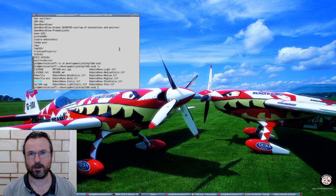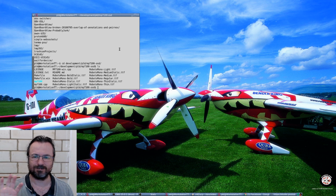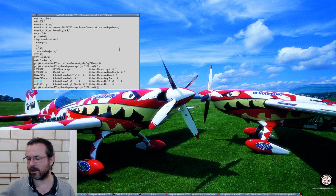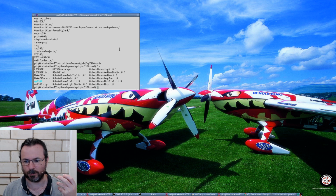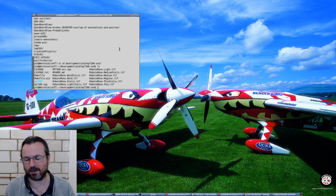Okay, so we'll get into it. The other night you saw we got the power supply up and running with the software. When I went to see if I could move it over to Windows, there was a bit of a drama with the driver situation, the USB driver for the USB TMC. It was more difficult than my alternative, which is that these power supply units also have a serial port. I didn't bother with the serial port the other night because I thought I'd try the USB, and Linux had direct communication with the USB driver, like you could just echo to the port and then read back. It was dead easy. But we're going to do the serial version tonight, which means I'm probably going to have to put back a lot of stuff that I took out, but that's typical, isn't it?